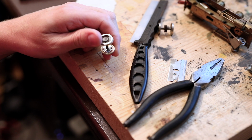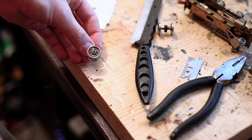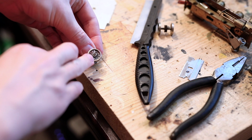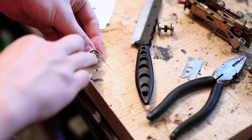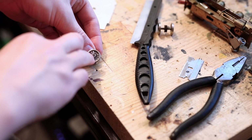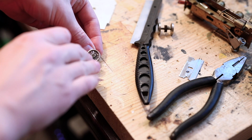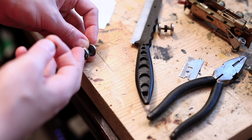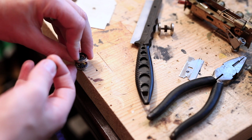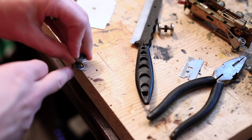Now that all the wheels are unassembled, then I'm just gonna hammer one side down. I'm gonna lay this flat on the other side of the table. Note that where the screw goes into, there's that sticks out a little bit further, so I want to hang that on the edge of the table so I don't push that. It'll flatten that and probably push the wheel sideways and even drive it down the shaft. So I want to take that and just put it on the edge of the table here, so it will hang off because that is sticking off.